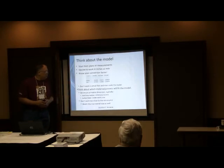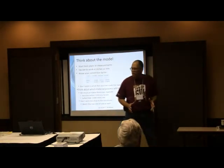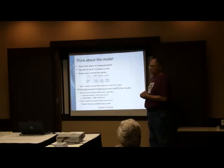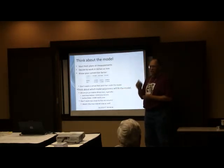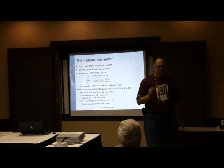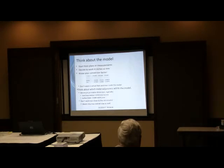Think about which material and process will fit your model. And we talked briefly about this, okay? So your minimum wall cross-section in many of the processes, including that white plastic that you've all seen now, is about 0.8 of a millimeter. I like to stay away from the minimum and keep that to about a millimeter. So if you need to do real thin sections, this process may not be for you.